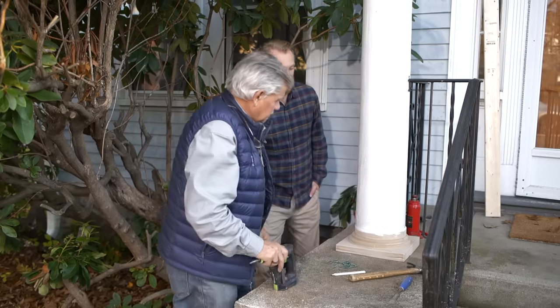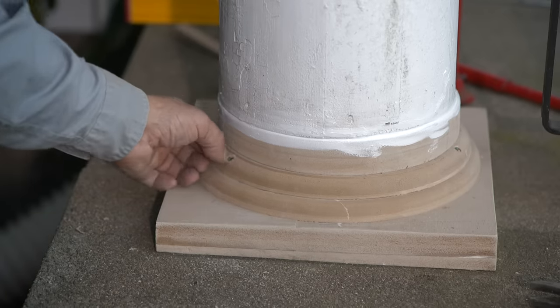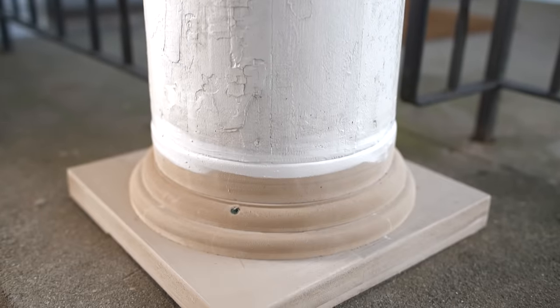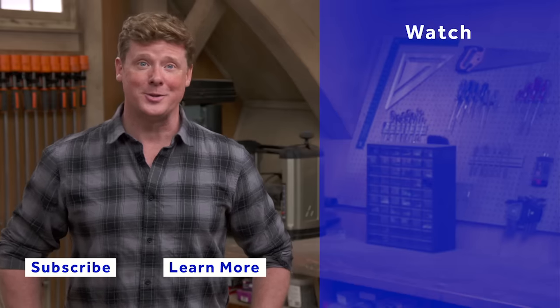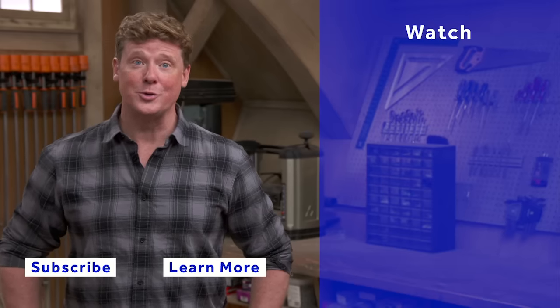Sam, your rotted post base is all replaced. I think it looks pretty good. It looks brand new. So now whoever's going to paint this, make sure they do a light sanding, put a primer on, and then fill all the holes with an exterior wood filler. Sounds good — I think that person is going to be me. Well, it's time for me to clean up and get out of here. I appreciate it, Tom. Thanks. My pleasure. Thanks for watching. This Old House has got a video for just about every home improvement project, so be sure to check out the others. And if you'd like what you see, click on the subscribe button to make sure you get our newest videos right in your feed.